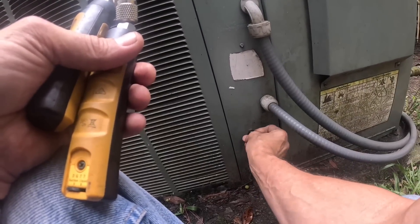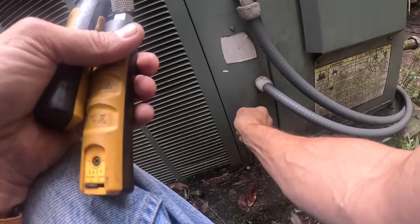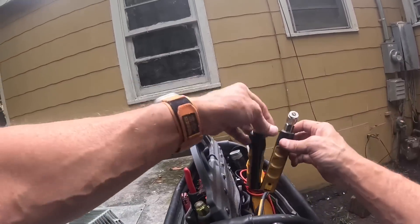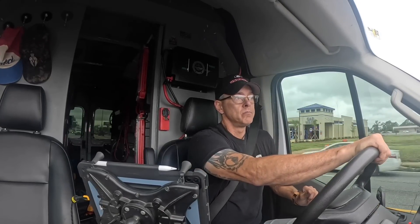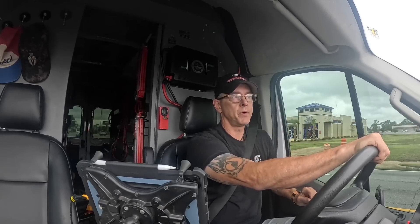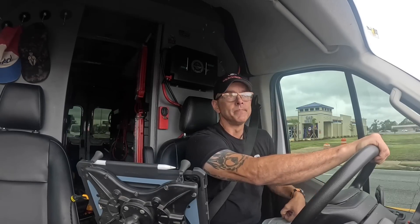I'm gonna leave this one alone and pack up. There's no way I can charge for a coil like that — that's probably my fault anyway, that wire coming off the contactor, because I just wired up a condenser fan motor there. Just one of those things. But it did show why you need to discharge your capacitor before you check it. Thanks for watching guys, I hope you enjoyed. If you did, how about a like and subscribe, and I'll catch you on the next one.